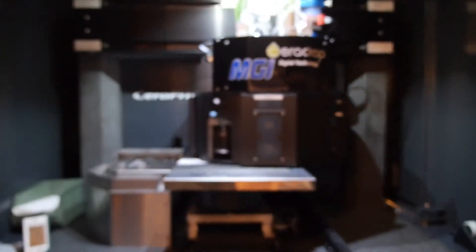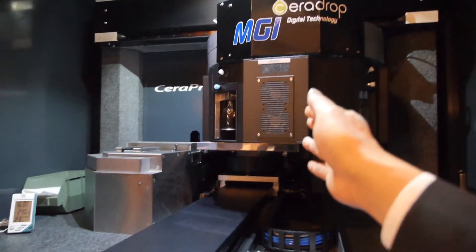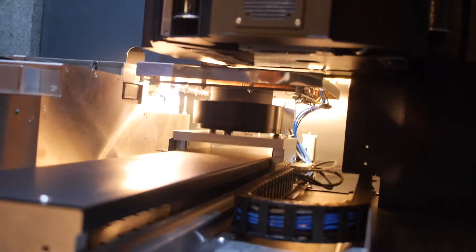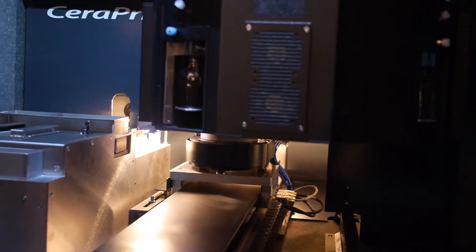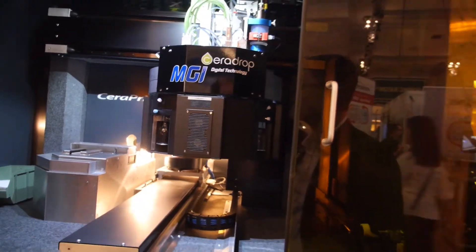So it's finishing through the application right here. When it finishes scanning the whole image, you will see the stage being presented to a curing system. Here we are lighting up energy photons to heat up the functional ink to drive out some of the water components. Then we have another process station behind that which will use photonic curing technology to sinter the metal and fuse it together and make a conductive track.